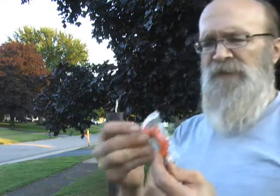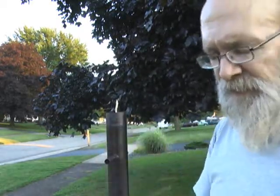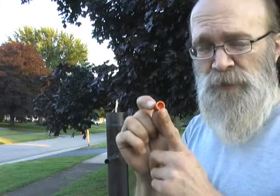Next, we have here a little packet that's got three sheet metal screws for putting the housing on and three wire nuts. Now, when we get to doing this, there's two schools of thought on using the wire nuts. Some people tend to wrap electrical tape around them, which in some places is very advisable. It helps keep them secure. However, in an exterior application, wrapping it with electrical tape is going to give a potential, if they get wet, the moisture is going to be trapped in here and it's going to cause electrical problems. Okay, so we're going to go just the good old-fashioned way. We're going to forego using any electrical tape on there and just make sure that they're good and secure.